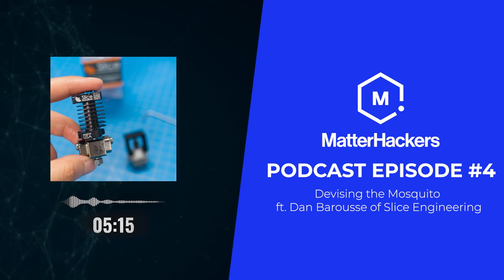We needed something like that to go through this process — an engineering material, difficult to mess with. We realized we had limitations with the 3D printers we were using and they couldn't print this thermoplastic. Even though it's a hardcore thermoplastic, it's still thermoplastic — it goes through the same states of matter. It's solid at room temperature, you heat it up, it goes into this gooey glass transition state, and then it becomes a liquid. It's like a fancy hot glue gun — that's the hot end, the hot glue gun part of the 3D printer.